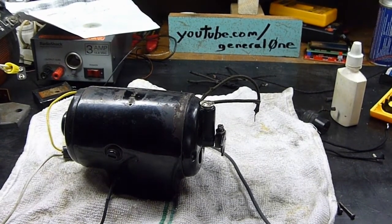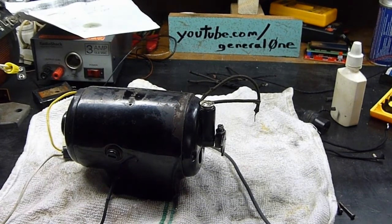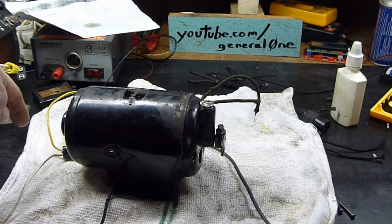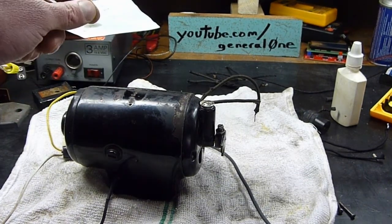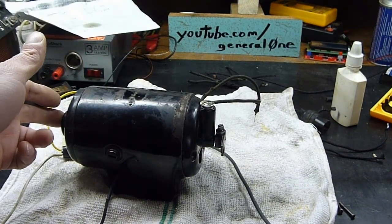I've been fiddling more with this little electric motor and as you can see the rear end cap is on now. I actually have it wired up — what I have determined is it's not a start switch, it's a speed governor. I apologize if I've said that already. These videos have been taken over the course of about a week. Anyway, we have our one line coming in here going into one side of the motor, and that goes directly to the rear contact on the switch.